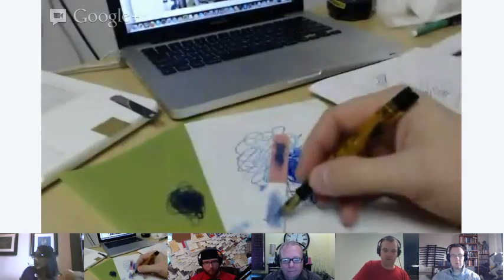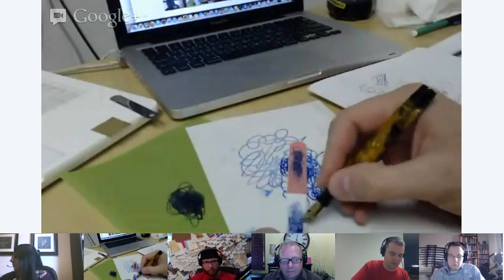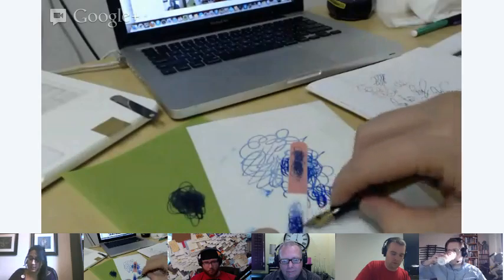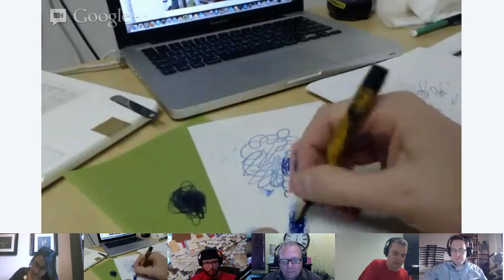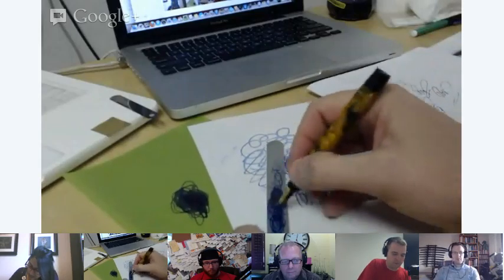So again, I did that on Mylar paper. If you're doing the same thing on micro mesh, then you're just going to start, if you need to, with the white. And again, experiment with these. See what the pink does for you. Test it. See what the white does for you. If I were doing this, I would do some figure eights like this. I would move around. I would go a little low, go a little high, rotating and moving it the whole time. Then over to the micro mesh, same thing.